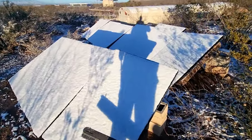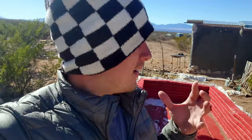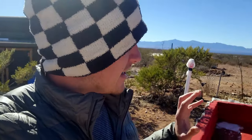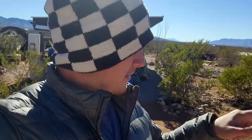Desert problems — early morning snow shoveling our solar panels, fun. We're moving on to the next step of this build and we're getting our buttressing in. What this is going to do is basically provide support for these longer walls because when we have this thing full of water it's going to be pushing a lot of pressure outward, so these buttresses are going to make sure our build stays secure and stable. The first thing we have to do is get water onto the ground and get some gravel down so that we have a stable foundation for our bags to sit on.